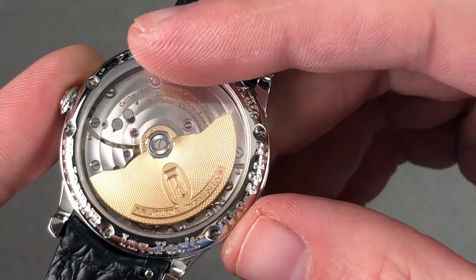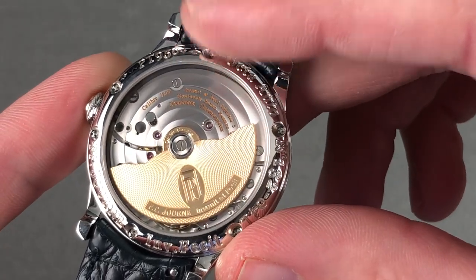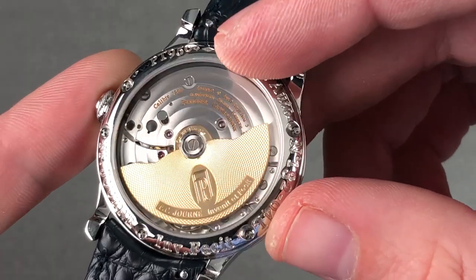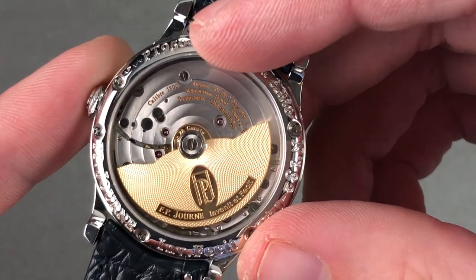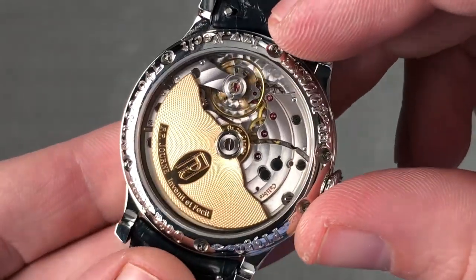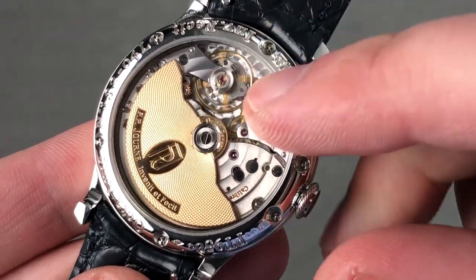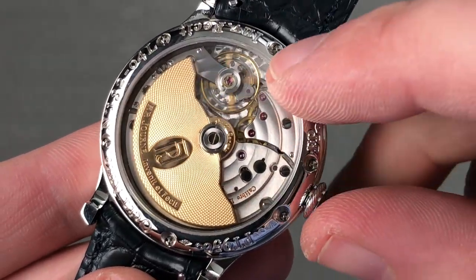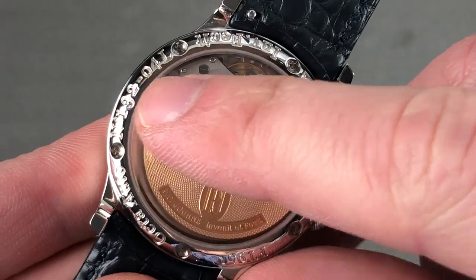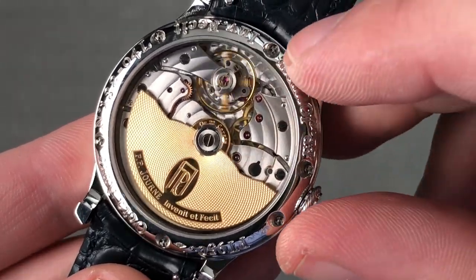You'll also appreciate the brass movement — rhodium-coated, which makes it appear silver — discontinued around mid-2004. So both the case and the movement were probably joined together around mid-2004. The discontinued first-generation caliber 1300 is a bi-directional winder, versus the later unidirectional winder, so it doesn't have a wild free wheel in either direction. So you've got the discontinued case manufacturer, the case date stamp, the case size, the discontinued brass movement, and the first-generation caliber 1300.